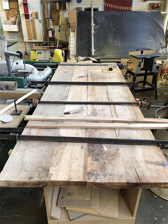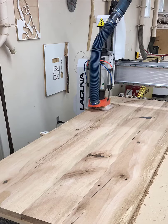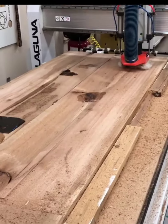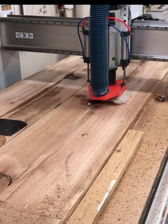The wood cupped pretty badly, so I wasn't going to be able to just do two book-match slabs. I had to break it into four thick boards, which is what I did. Ultimately, I glued it together with some dowel pins and filled the major voids with epoxy. Once it was all glued up, I knew it needed to get flat. Fortunately, the neighboring high school has a big CNC router, and they let me bring it over and milled it into two perfectly flat sides.